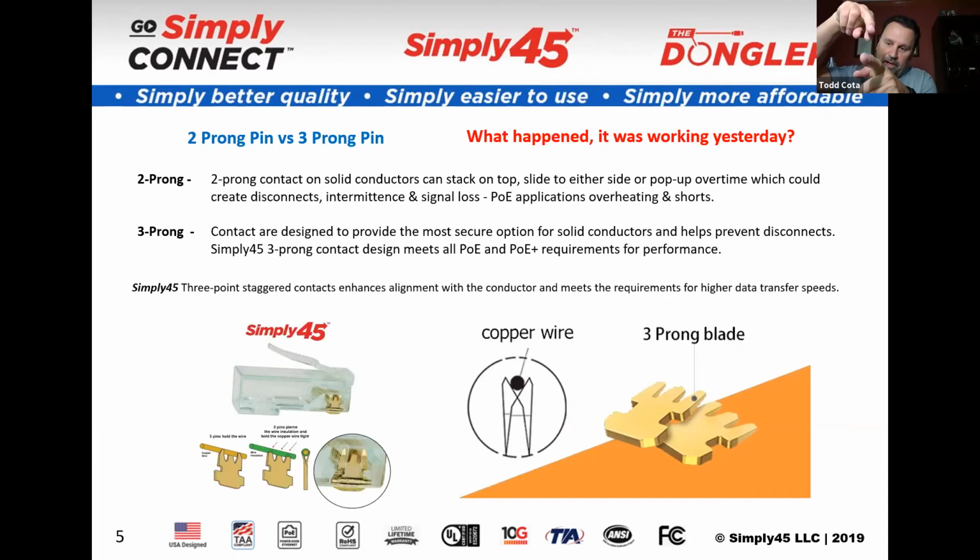So with a two-prong contact, if it does its job right, it's supposed to come over here and straddle over a solid conductor like this. Well, if the conductor's a little undersized or whatever, that contact could slide to one side or the other, or even stack up on top of that conductor like that, okay? Which means it's not making the best contact it possibly can make.